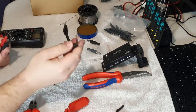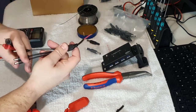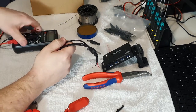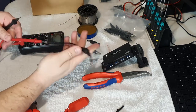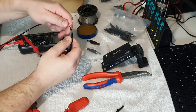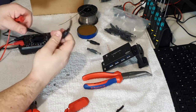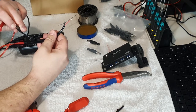Now I'm fairly sure which cable goes where, but it's always important to check to see which cable is actually the middle pin here. So I put this measuring device to contact, and then put that into my center, and then put it to the red. You can hear the tone. You can't hear any tone for the black one. Just to verify the black one. And that's how you know that the red cable is supposed to be on the center pin here.